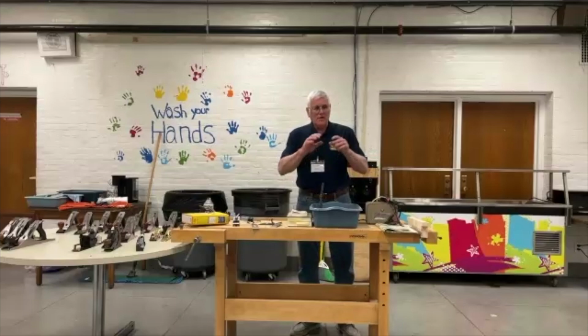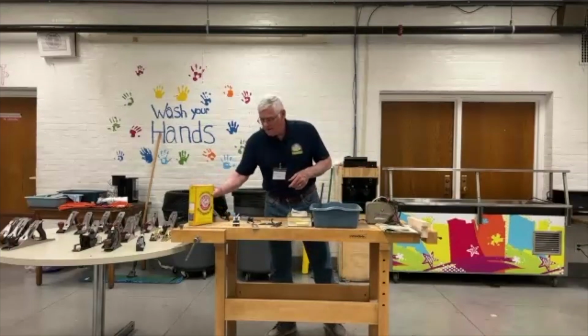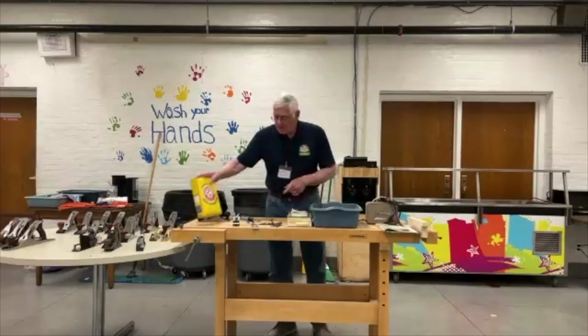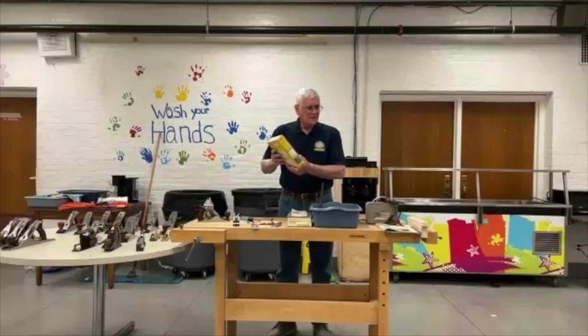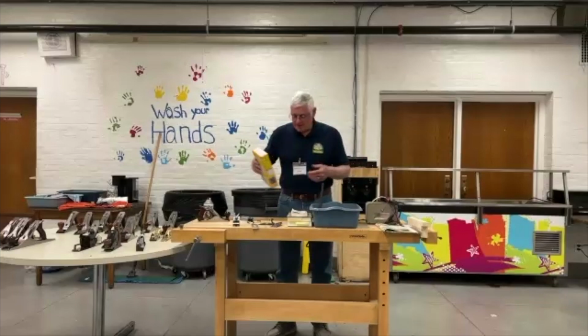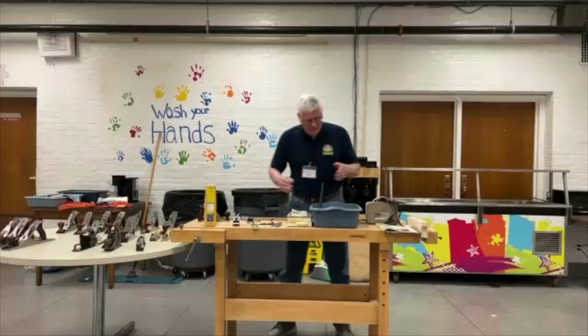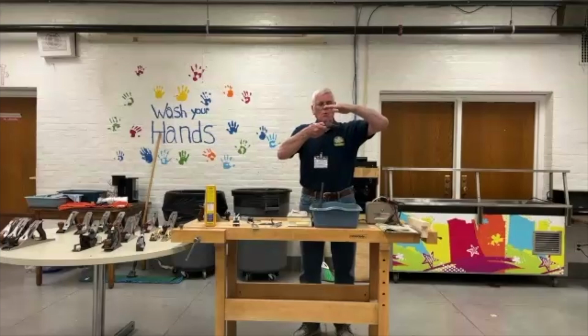I mean, they're on the internet, they do say a certain amount of water for a certain amount of washing soda. It's got to be soda. It can't be soap. I'm sorry, I'm saying it wrong. It can't be detergent that you wash clothes with. You can wash clothes with this, but this is soda. You need the sodium for the reaction with electricity. So I normally fill this up high enough that when I put this in there on a piece of wood, the water covers it.